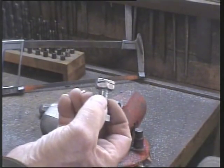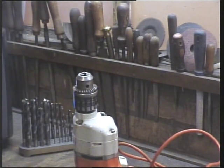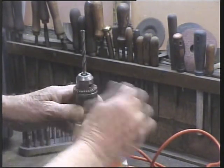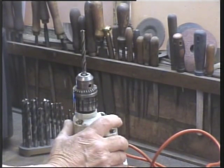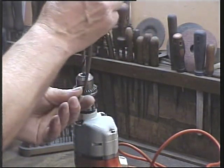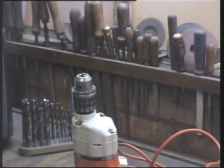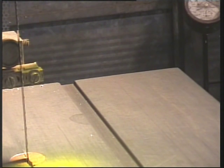You can see I've just closed up the gap — now it's a stiff nut and it will take a spanner to put it on, but I guarantee it won't come undone. If you're out on site using an electric drill with a proper chuck instead of these keyless ones, and you want to change to a different drill but the key has gone — someone's pinched it or you've dropped it in the long grass — a quick fix is to find another drill bit that will fit in the hole of the chuck and then use a screwdriver as a fulcrum. That way you've undone your chuck.